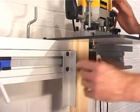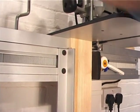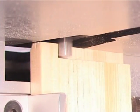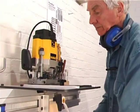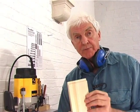With the wood rat, we don't have these problems because the wood is held as it goes, provided that we go round clockwise, i.e. the wrong way, we get perfect, clean cutting. It's like having a power feed.